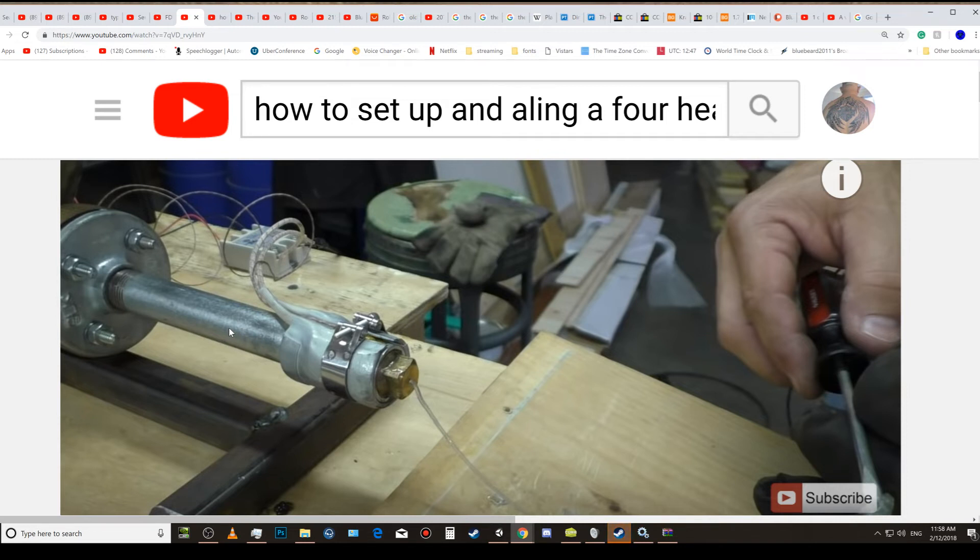He's then going to use a water bath — he has some idea about rehydration of plastic and has read the material data sheets. But the problem is he's making plastic that's going to be extruded — you cannot rehydrate plastic at this stage. If you're making filament for your printer, do not water bath it — you'll have nothing but trouble. You only water bath plastic after the final print, not during the filament making stage.